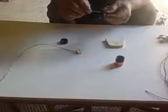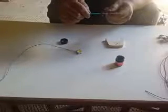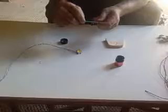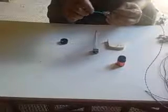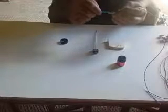Just a little bit does it. You want to smear it over the entire surface of the heatsink, in as even a layer as you can get. And the entire surface of the LED light, and as even a layer as you can get. It's a pretty thin layer, but you want to make sure that there are no gaps in between your heatsink and your light.